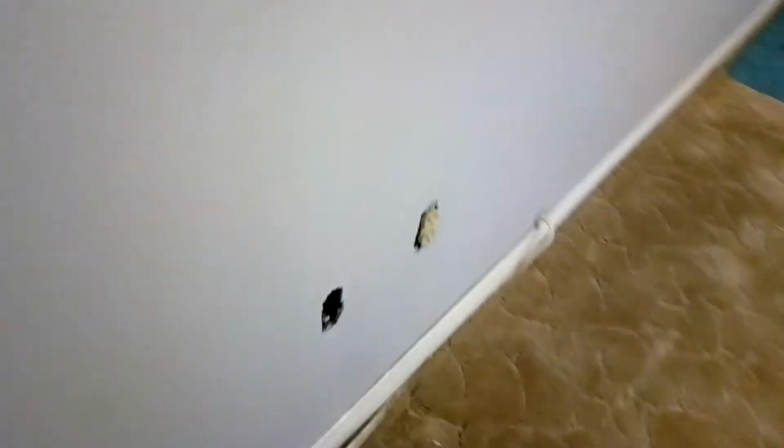So to do a quick recap, take off all these little panels, and you carefully paint around. Even light switches, carefully paint around them. When you have a screwdriver, you tighten top and bottom here. Don't stick it in the sides here because there's hot wires in there. Most of the people that install these things are usually a little bit on the lazy side, and they don't do electrical tape around them, like it says to do on some manuals. Some people believe in that, and probably some codes have that too.